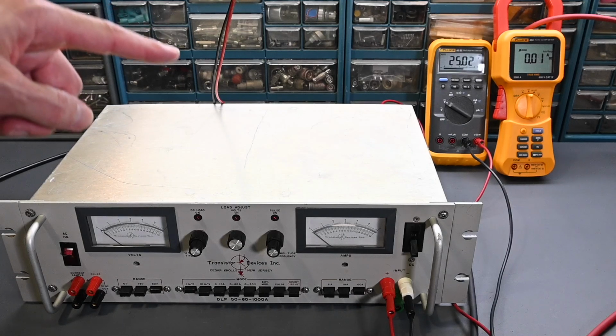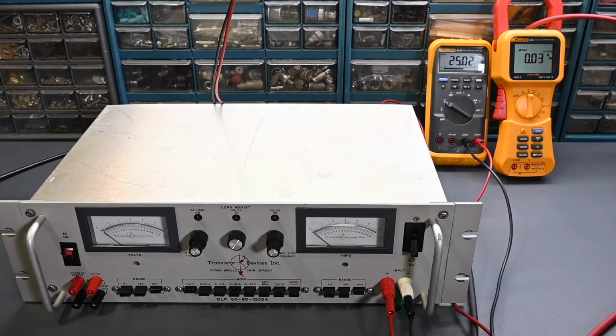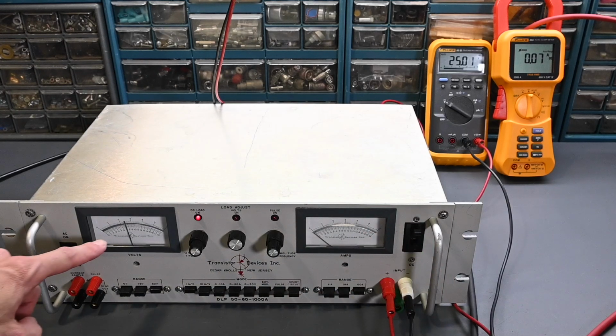And then the wire that you see running right there is going to another power supply, and then I'll use that to test the external modulation input, and we'll do that as a final test. So that power supply is not even turned on right now. Okay, so let's power up the Dynaload. So fans turn on. I don't know if you can hear the fans because the noise reduction on the microphone may be blocking them out. And turn the circuit breaker on. Perfect. So that comes up 25 volts right there.